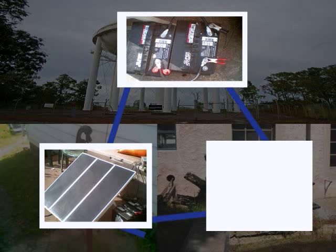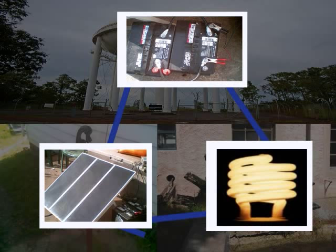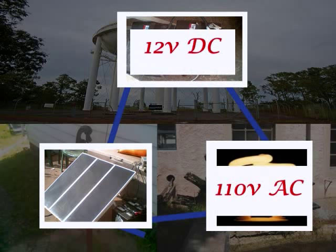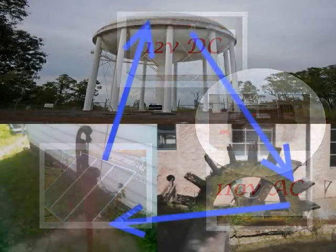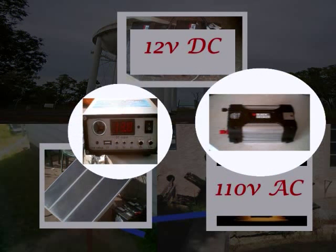In my little system I'm using 12 volts. You could get better efficiency if you go to 24 or 48, but 12 is the cheap way to go. Our magic water wheel becomes all the stuff we want to use in our house. But there's a problem — the stuff in the house runs on 110 volts AC, and our batteries and solar panels are running 12 volts. We've got to put a device in between the two that converts the juice — that's called an inverter. We don't want our water tower to overflow or go empty, as that would ruin it in the case of batteries, so we have to get another device called a charge controller to manage that end of the situation.